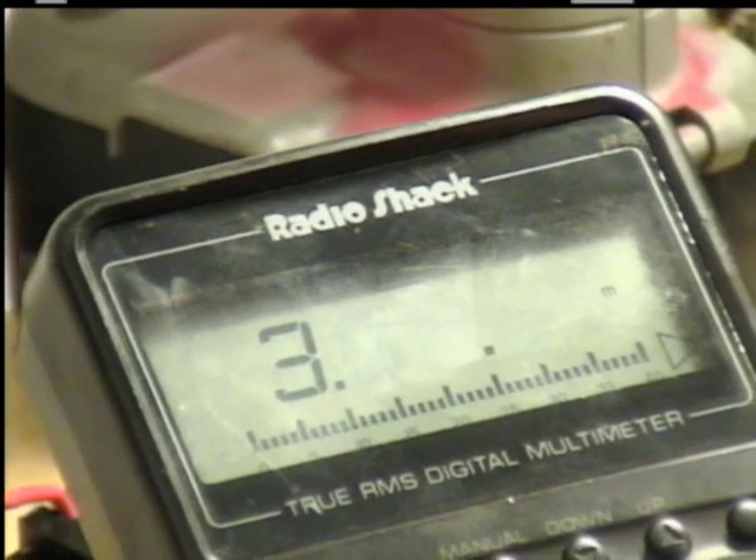When you replace these diodes, make sure that you get them back in the circuit board the same way they came out. Make sure they're the same ratings — same peak inverse voltage rating, amperage, and voltage. Be sure you insert them the correct way when you replace them. All you have to do is look up the numbers on the diode. You can go on the internet, find out what it is, and order your replacement if necessary. That's all there is about testing a diode to see if it's shorted. You can use an ohmmeter to do the same exact thing — it has to be conducting in one direction only. I hope you enjoyed watching the episode. Thank you for watching.